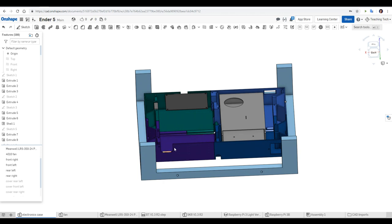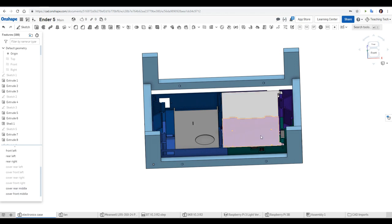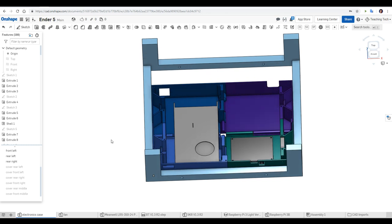As you can see at the back, the cords still exit in the same corner. The power supply cable still enters in the same corner, and the power switch still resides in its corner too. One main difference is the mainboard is flipped upside down and actually housed on the underside of the lid. We have a double panel that it bolts to, and it's hinged on the sides so it can flip up, meaning you have access to it without having to flip the printer upside down like with the original design. We have four more printable pieces to cover the top.